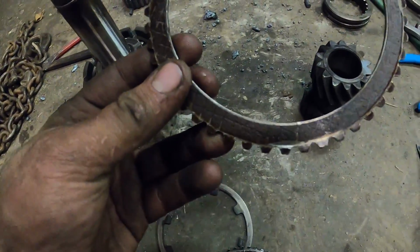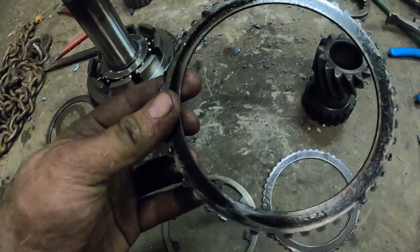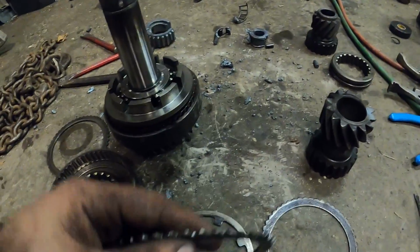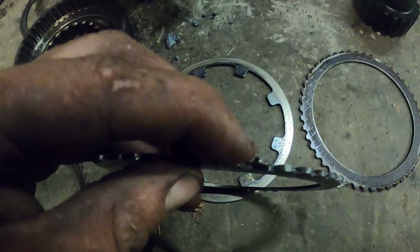These are plates that go in between clutch plates. So that's a clutch plate that's extremely worn. Got all sorts of stuff missing. That is a clutch plate that has nothing left to it, and it's smoked. There's stuff bent. So the whole reason it wasn't moving properly, that's bent right there.